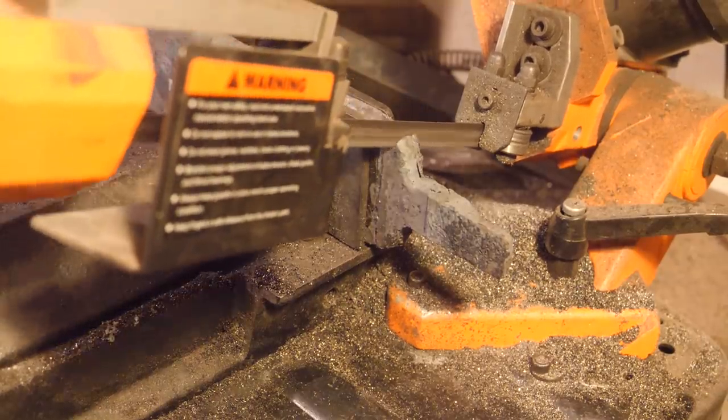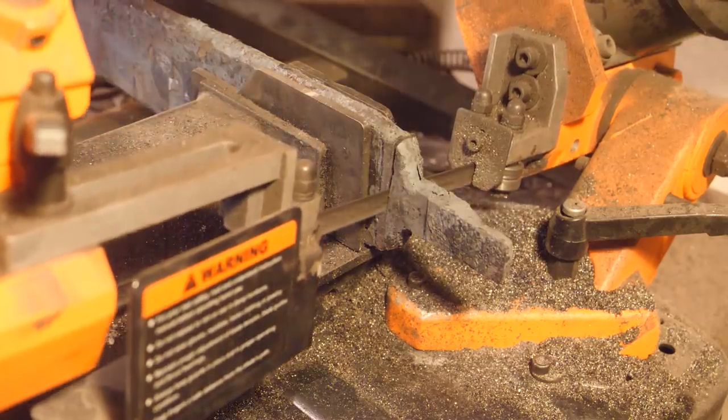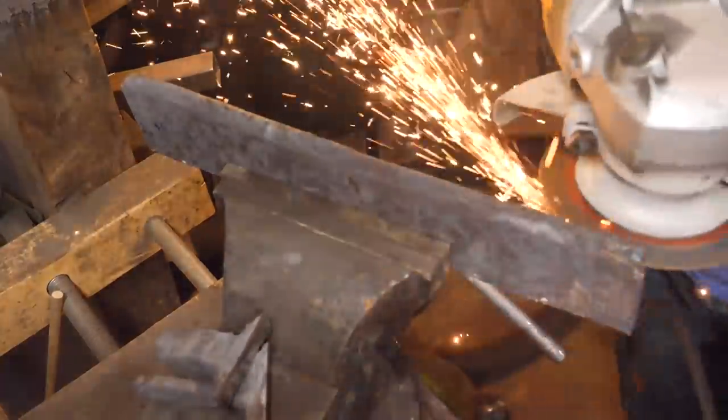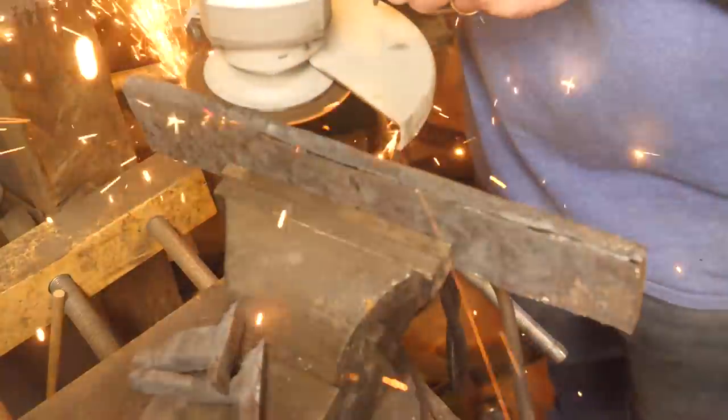Things are going to be sticky because we only compressed the canister in one direction. We didn't really rotate it and press it again, which would have pushed some of those surfaces that didn't weld back apart. Doing so, though, would have elongated our round bearings and turned them from circles into ovals.